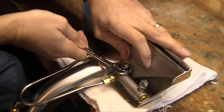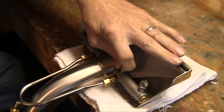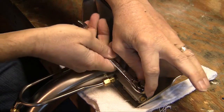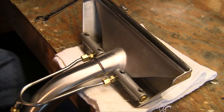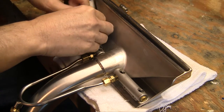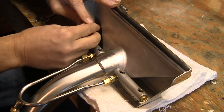Another really great reason to have jet extenders: a lot of cleaners these days are actually using glides on their wands. When using a glide, the jets are actually further away from the carpet than what they're designed to be. So by adding the half-inch — which we're going to do right now — or the one-inch, you end up getting the jets closer to the carpet again.